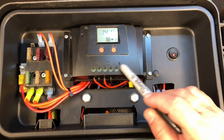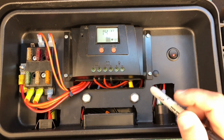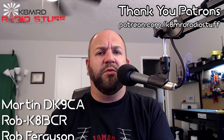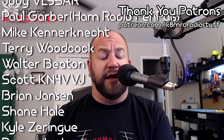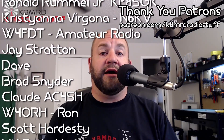So that's kind of how that works. Why they say not to use the load port, I don't know — but they don't recommend it, so I don't. Never have. Can you plug something in there? Yes. If you did, I'd keep it a lower-current thing, but that's what BioEnno recommends. That's what I did, and that's what I'd recommend you do too. Hopefully that sheds a little light on the subject. Maybe do some research and find out why we don't want to use the load side, and report back to me — I'll expect a full report by next Mailbag Monday. It's a great question — thank you for writing in.